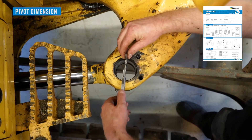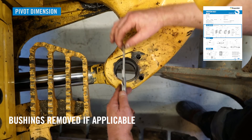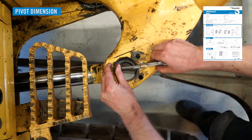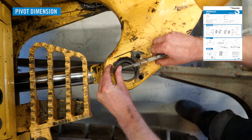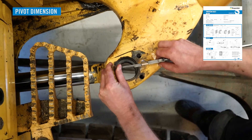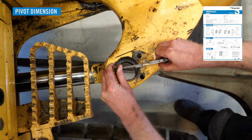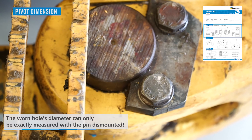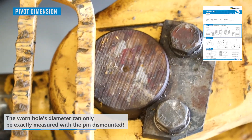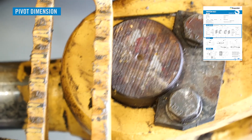Fill in the diameter — fill in the original diameters of the holes of the mounting lugs, bushings removed if applicable. If the holes are more than one and a half millimeters worn, measure the maximum and minimum diameters of the worn holes, with measuring accuracy plus or minus 0.2 millimeters. By moving the pivot back and forth, the play between axle and lug can be estimated even with the pin mounted, and lug diameters can be stated based on this or other estimations.